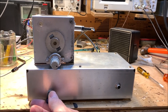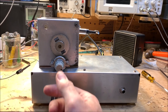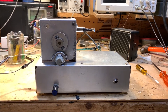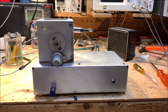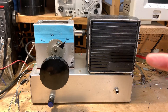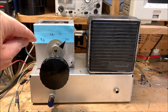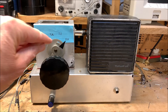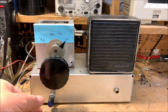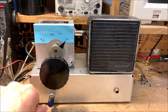Some sort of signals at 125 watts — anyway, 40-meter CW is coming through even though the band's kind of closed; it's like 9:40 in the morning here. It's kind of cool using that old resurrected rebuilt VFO from the Galaxy 5. I just wanted to give you a demonstration of how this looks so far. I have a little speaker sitting on top of the box, which holds the BitX40 board. Here is the Galaxy 5 VFO — I calibrated it this morning, added a little capacitance so I could tune the entire 40-meter band, and worked up a quick and dirty dial calibration. It's 9 o'clock on Friday the 15th of May 2020. Let me crank it up — the band still seems to be pretty open so we should get a lot of signals.